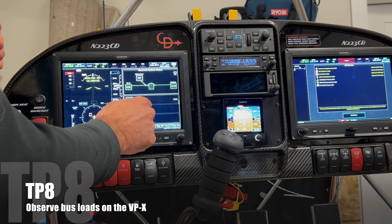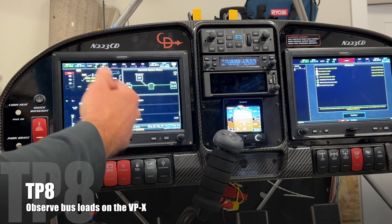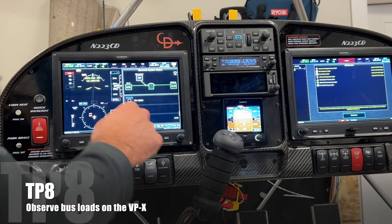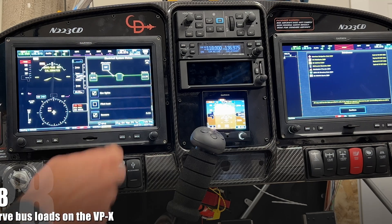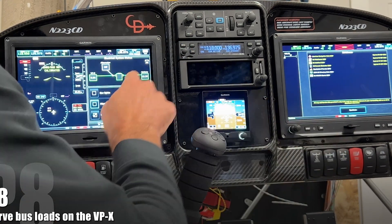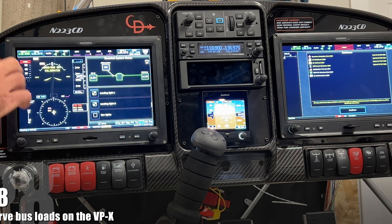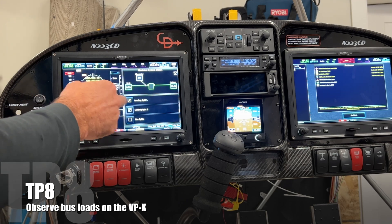Electronic ignition 2 — I can manually turn that off because I'm only going to have one hooked up through the VPX. The other is directly hooked up to the battery. Without nav lights hooked up and without a multimeter on my cable, it's just insulated with some electrical tape. So I can safely throw the switch and see if this check mark does that. Nav lights on — look at that. And now let's check pitot heat. Good, we've verified that's working. Let's go landing lights. Both of them turned on. You'll probably be able to see, after I've configured the wigwag, especially in test mode at zero knots which we are right now, we could probably see them alternating. There should be an annunciator right there.